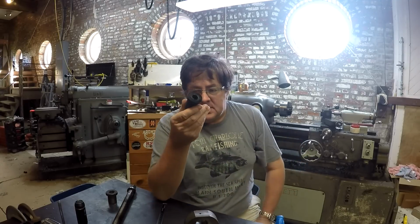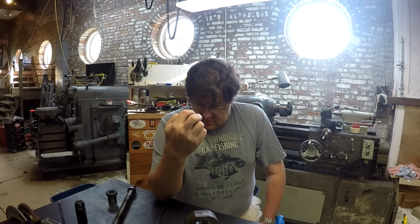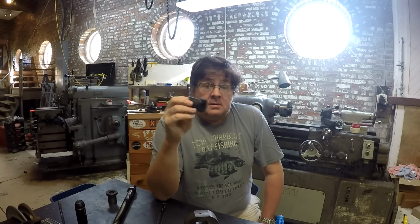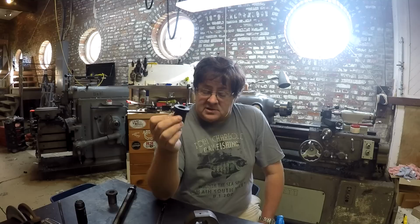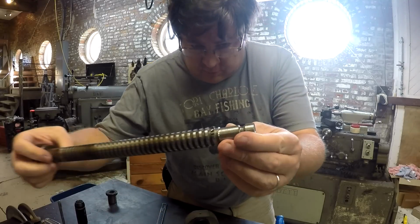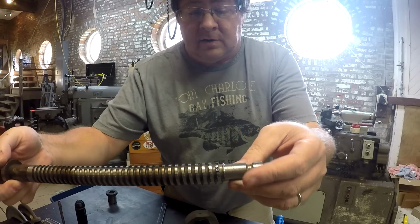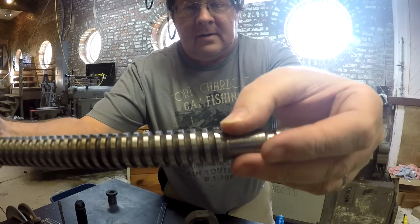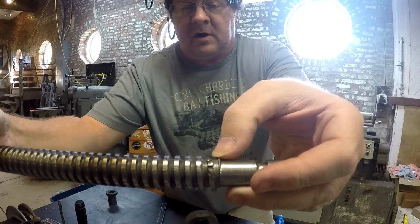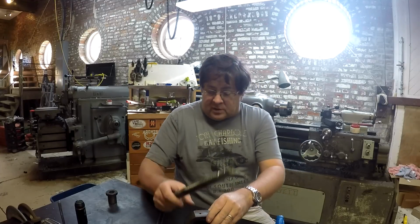There you go. Honestly, if anything, it's too good. There's absolutely zero clearance in there, as you might expect. So what I did was, and I don't have a tap, obviously it matches this. I took my screw, the last few threads of the screw in here that are up in the jaw and you never actually get used. And I took this last one and I slid it up here with an abrasive blade. And then I worked it back and forth